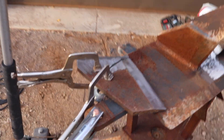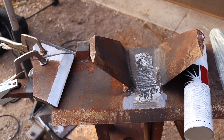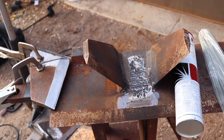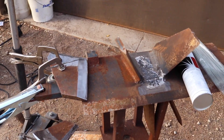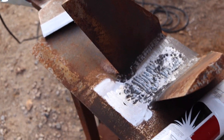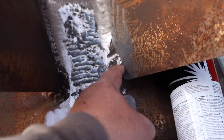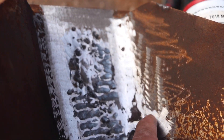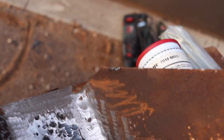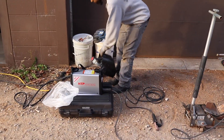So now we're going to fix this one here, straighten this back out. Rumor is it's AR400 — I could cut it in the bandsaw, so I don't think it's AR400. It is a little bit harder than mild steel, but not that much. What happens is, as it's being welded, it kind of hardens the knife a little bit, and then it cracks just above — see that hairline crack coming in here? Tim, we didn't fix that. Let's go in there with the grinder and just hog that hairline crack out before we do this.